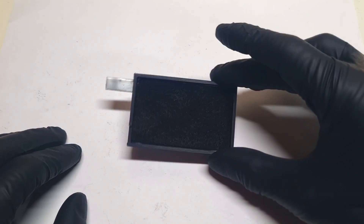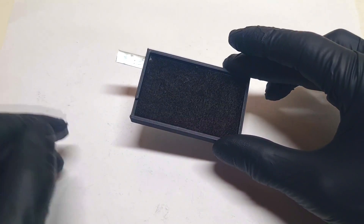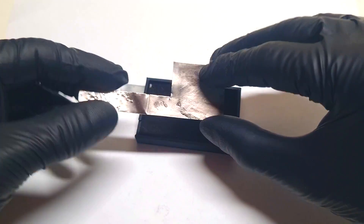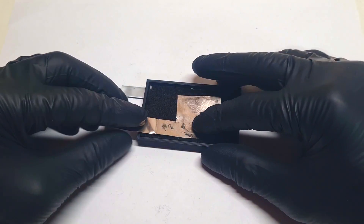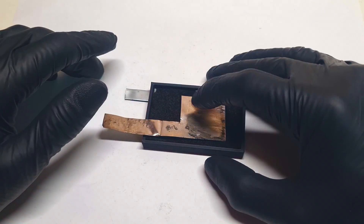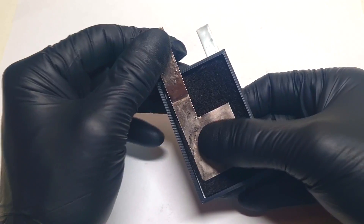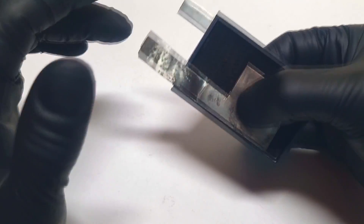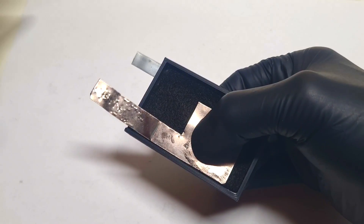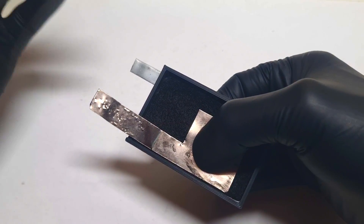At this stage I need to fill - I mean I need to wet everything with the electrolyte. On the top I also need to put some positive current collector. And in the end I need to seal everything. This will be my basic battery using this carbon felt for the positive active material. You can already see that this process of making the battery is way easier and also way cleaner.